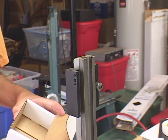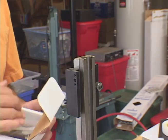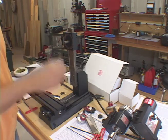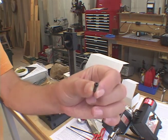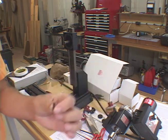We'll install this on the new lead screw for the z-axis. The next step says bolt the template parallel to the table where the base will be drilled. Now we're getting to the point where we're going to drill and tap here, and here. It talks about using the provided SHCS - all that is is one of these little screws, standard screws that come with the kit.